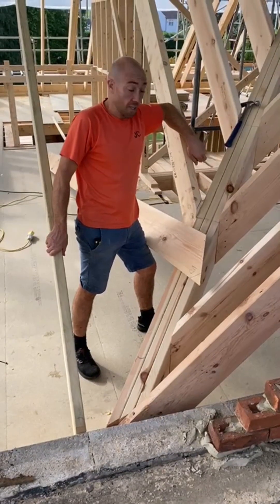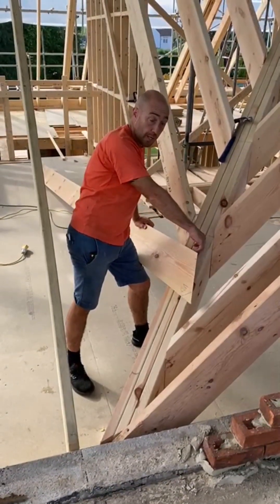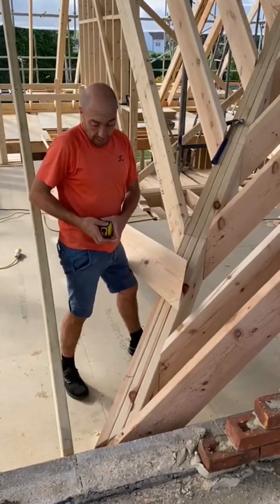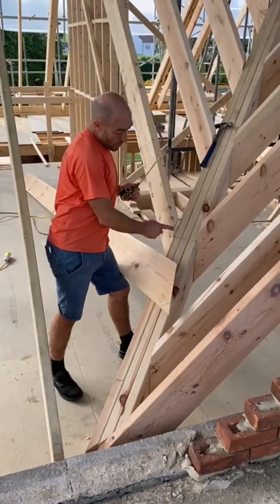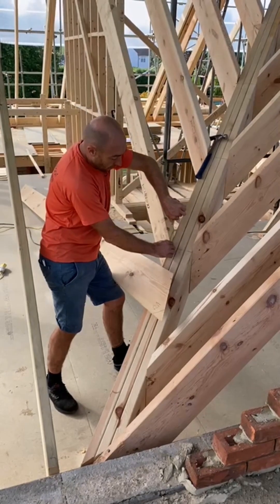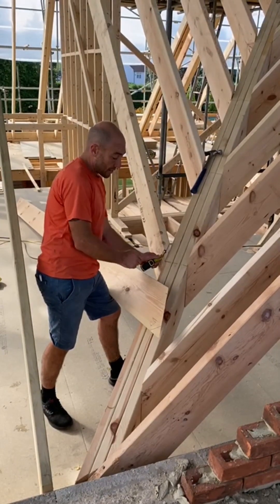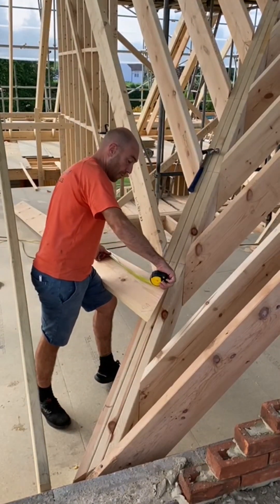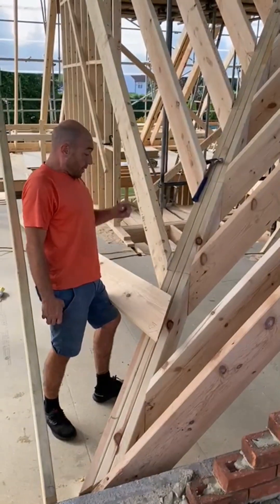Good work tips — cutting jack rafters. There are a couple of good tips. When this runs right through the rafter, it goes to the centre point. Everything works at the centre point, with tray or whatever detail you've got. Sometimes trying to get these marked out — if you're measuring off a rafter and you've got your point, say 400 centres — you're not measuring to one point, you're measuring to that point. So once I've got that plumb cut and know how far to come down, I'd have my parallel. That way makes it easy — hold it at the end where I've cut the plumb cut, run my tape through with a pencil or thumbnail line, then measure down, and that gives me my mark.